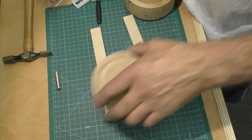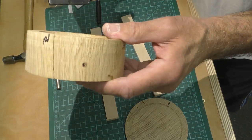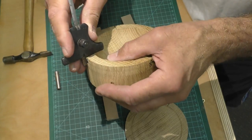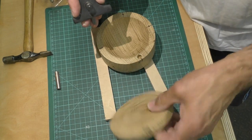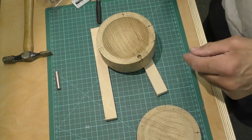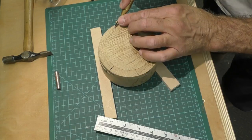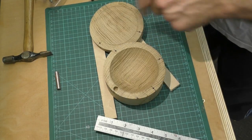The final method is the depth finder, which is what I used in my original project. I drew a line, put the square onto the rim, got it as square as I could, and drew a line, doing the same for the lid. We find the centre of that line, and with a centre punch we mark the point on both the base and the lid. So now we have all our marks for drilling.